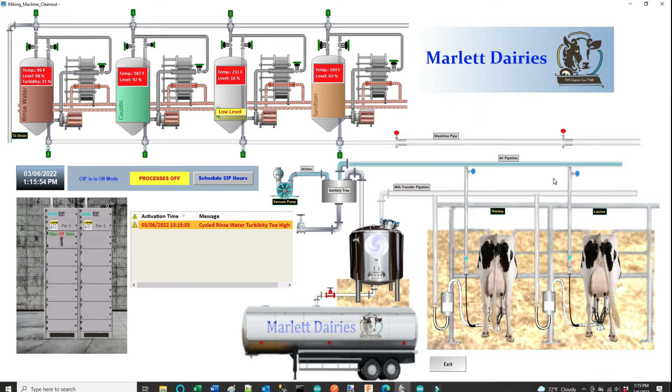You can see the chemical storage tanks I'm monitoring, showing the levels and temperatures coming in from the remote node via MQTT. In the rinse tank, I'm also monitoring water turbidity — how dirty it is. I use a turbidity threshold of 20%: if turbidity is less than 20%, it's recyclable and goes back in the tank; if not, it goes to the drain.